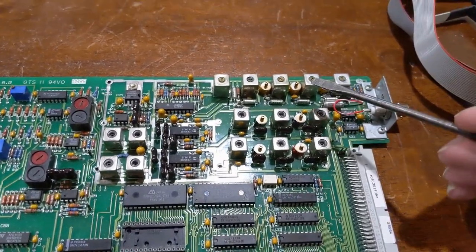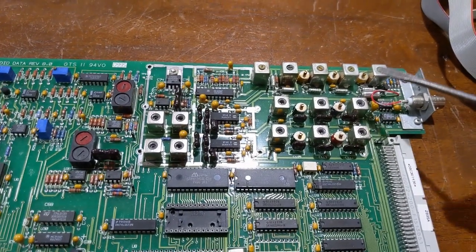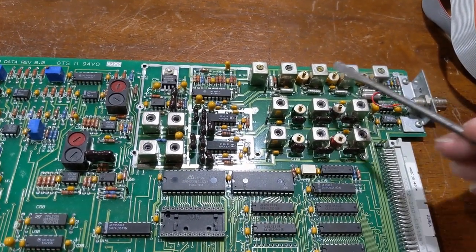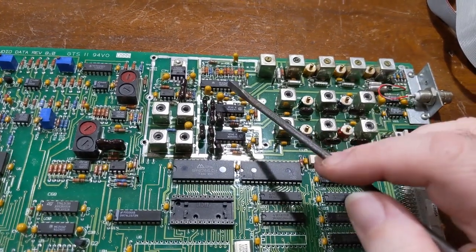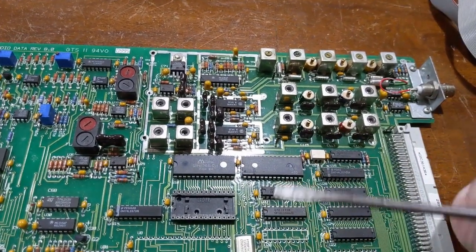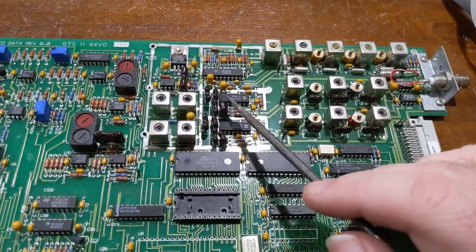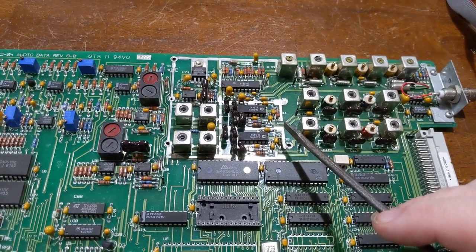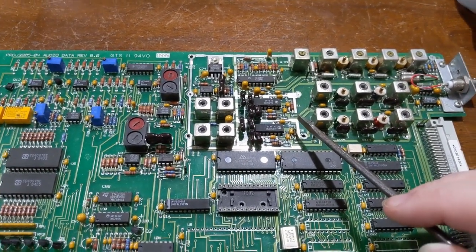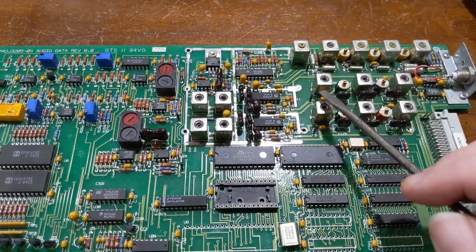So there are three receivers here. So receiver number one's IF strip is the FSK encoded serial data stream that the program and the data and all that stuff is stored on. Then these two are FM audio channels. So I don't know if they used them or not because it had external audio inputs, but these were for getting alternative audio.